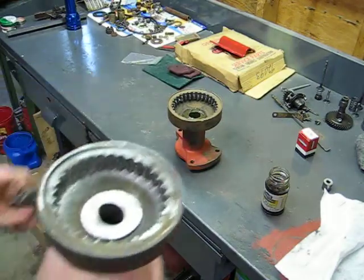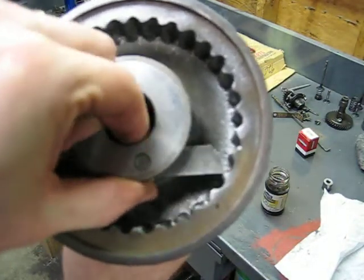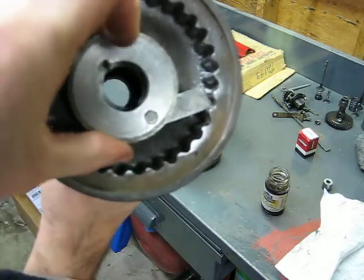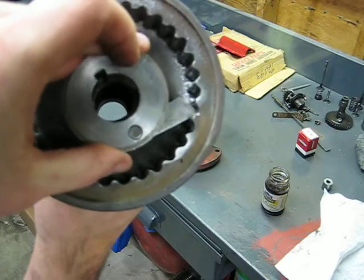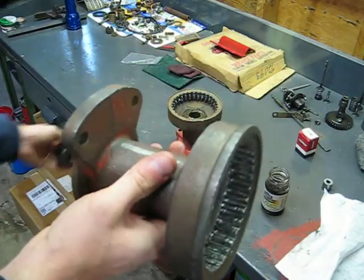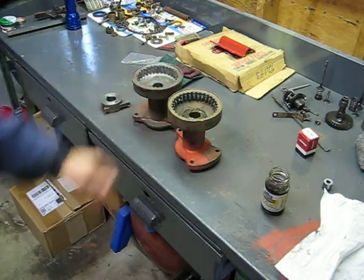And then the next thing I have to do is get in there with the paw and make sure each tooth spacing, the paw locks in fairly well. I mean, I'm gonna line it up better with the axle hole and the whole 9 yards. But that's what I do. And that saves the hubs. I've done like 3 or 4 tractors this way. I haven't had a failure.